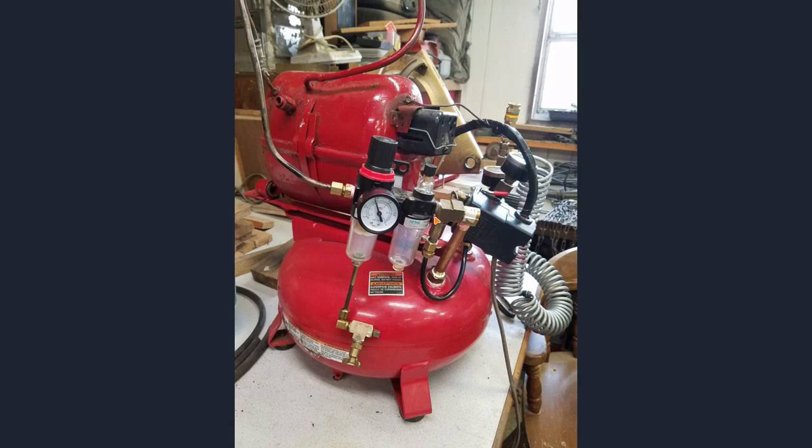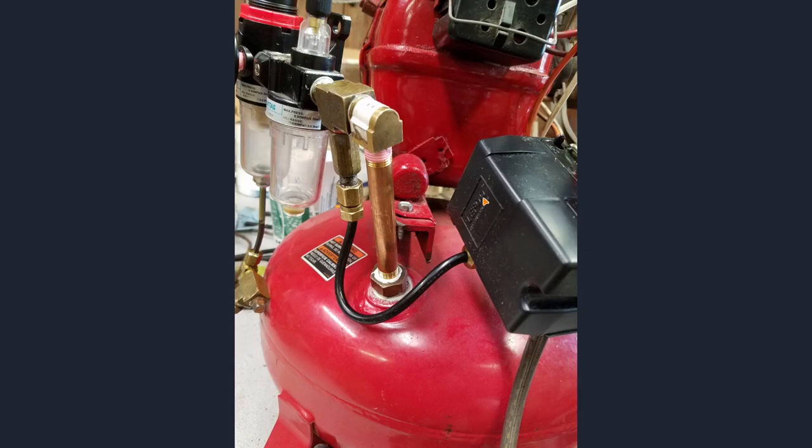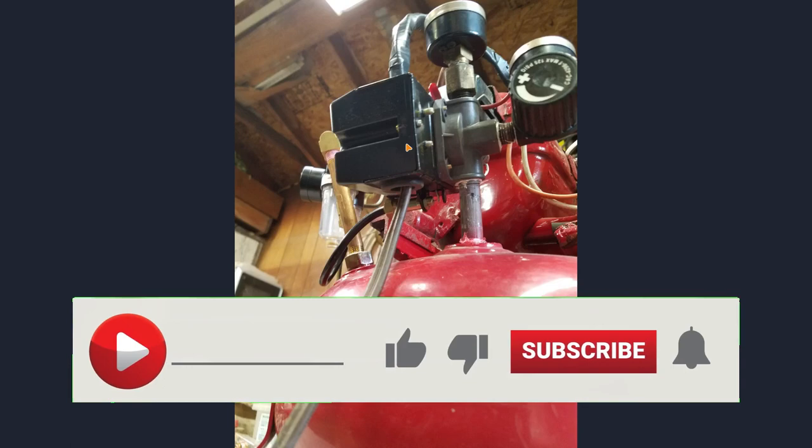After some more testing, I left this little short piece to drain it. This is actually a pressure valve, but I took the spring and the valve out so I could drain it easier — that later changes too. Here's a new control valve, and this is a pressure bleed-off switch. It bleeds the pressure off the head side so the electric motor will start. Once it starts, this valve closes and then it pumps the compressed air into the tank. There's a gauge that shows the pressure of the tank, and then this is the outlet.